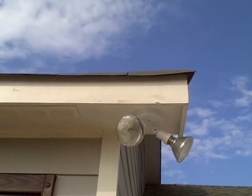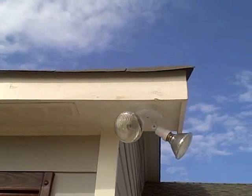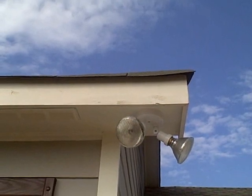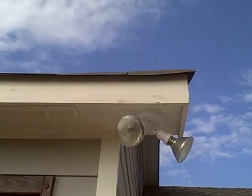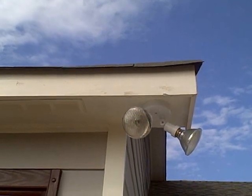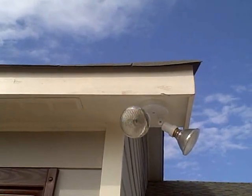The ideal situation in a perfect world is a three-coat system on exterior trim. You should have a coat of exterior primer — and that is a specific product, not paint, but specifically primer — to seal the open wood and give a good base coat for adhesion of the top coat.